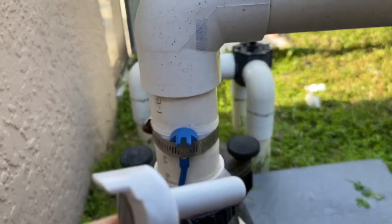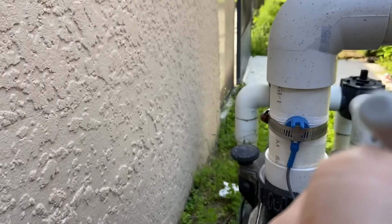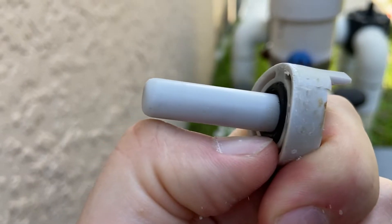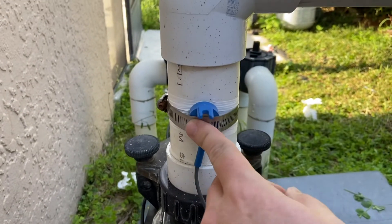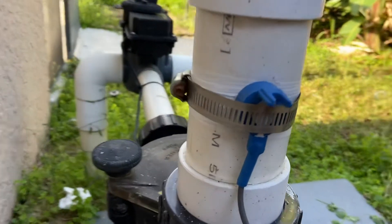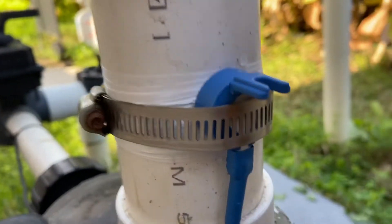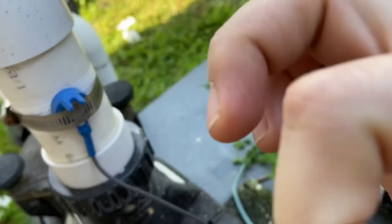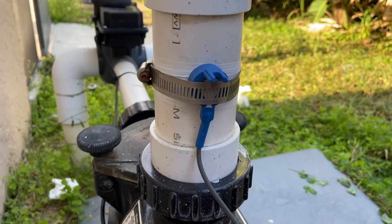There's a little hole that the thermostat just sticks into. The problem I had is there's a rubber gasket to seal it so water shouldn't leak. However, I think previous owners had tightened this on too tight — that PVC pipe is bent to the point where it's kind of flat and has lost the normal circular shape that the pipe should have.